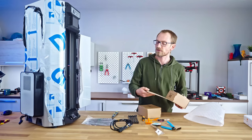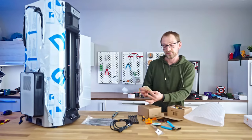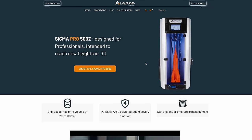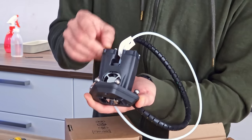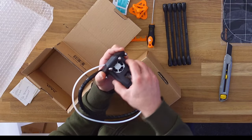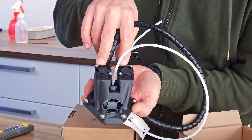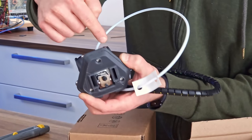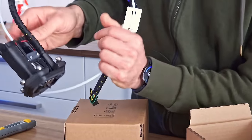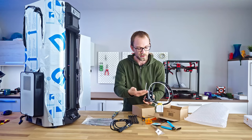I'm also missing some sort of a manual, so I guess that's gonna be online. Steel nozzle 0.4 for technical filaments — that's French. Interestingly, their entire website is in French; they don't have an English website, you have to use Google Translate to even figure out what you're getting. That sort of tells you how small of a company they are. So that is the tool head — steel nozzle on this one, that's hardened steel, with what looks like a copper block. This is all also FDM printed, and it's a fiber-reinforced, probably carbon fiber-reinforced material. Two fans on the top — that's a cool idea. These 25 or 30mm fans go all the way past the hotend down to the filament cooling ports. It has a little extra fan in the front that just cools the hotend. This looks like a fairly standard hotend but not one I've seen before, some sort of custom job built like a standard E3D hotend, essentially. And a little clamped thermistor — no thermistor cartridge.